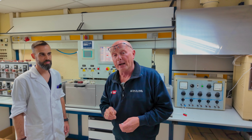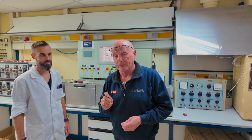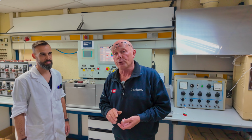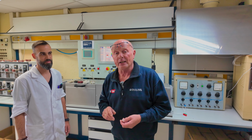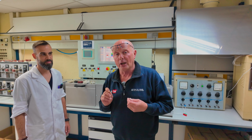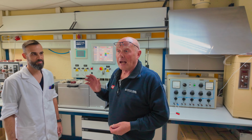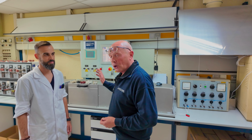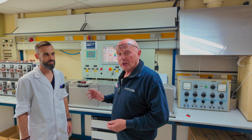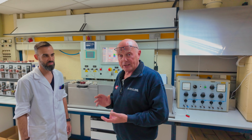Manufacturers today are buying too many components which have built-in obsolescence in them. If a cooker is used once a day and it is used for 2 years, it has most probably had 700 cycles on the Selector switch. And Victor has actually proven on many occasions with me that there are so many Selector switches here that have failed between 700 and 1,200 cycles.